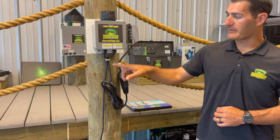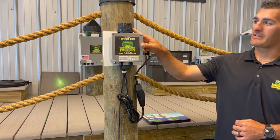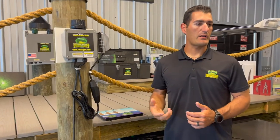From the GFI it goes through a nine-foot cable into the control box, directly to a photo sensor. The photo sensor makes the system come on automatically every night and shut off in the morning. One key reason for the photo sensor: it gives the light bulb a chance to clean itself. The light bulb is fully self-cleaning as long as it comes on every night. That's why the photo sensor is used — it keeps the bulb clean.